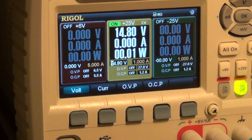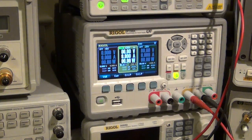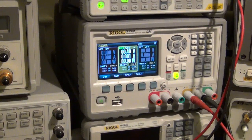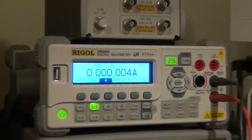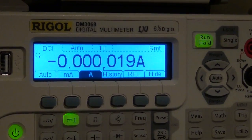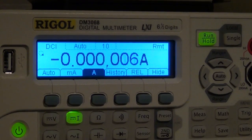So it's going to run and I'm going to change the LED. Okay, so the red LED is done. Let's try the blue one. Here we go. It's running again, 0.2 volts, 0.4 volts. Again, there is no current at the beginning because the LED hasn't turned on yet, as you can see. This LED will turn on at around 3 volts or so, or 2.5 volts.